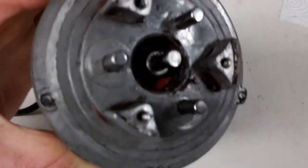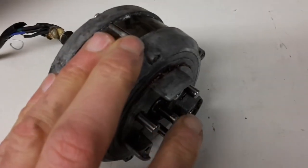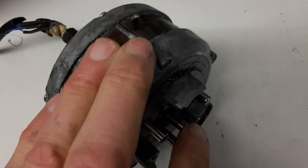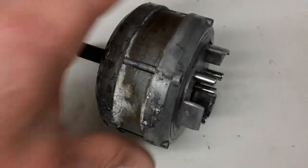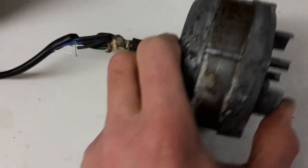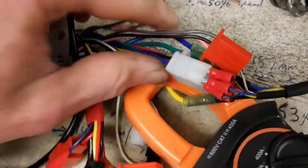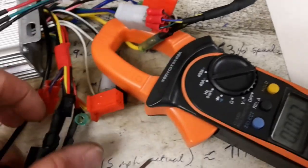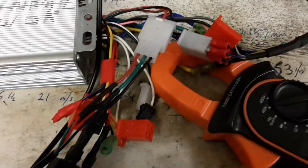So there we are back together. Now that's meant to have the three rollers in here which will act as a bit of a bearing as well, so it's only got one bearing in the middle. It's unsupported around the magnet so it may not be perfect, but it is symmetrical so it should be okay. We've got the controller set up with the hall sensors and the three phases on, with measurement on one of the phases on AC. The learn wires are connected so once I turn the power on it will go into learn mode.